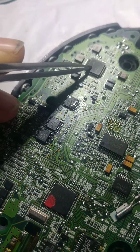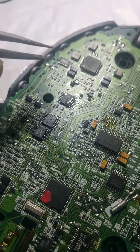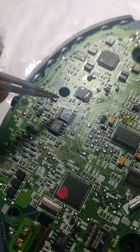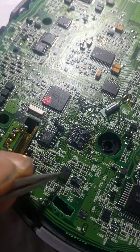This here is actually a radio tuner, which I thought was built into the remote, but it's not. This is your full radio tuner, and there's some parts on the other side. Some of the coils are always a dead giveaway for a radio tuner circuit. But here's your op-amp, here's a multiplexer, and then a little more research unveiled that this too is an op-amp.